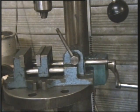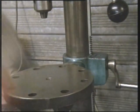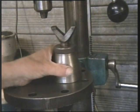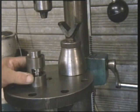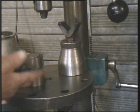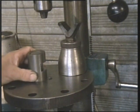While we're talking about milling machines, drilling machines, put them there. Oh, just dropped that on my toe, nearly. Okay, small jacks, adjustable jacks. This is for round stock in the milling machine, lathes, what have you. Here's a little block. It's made by a friend of mine who's a tool maker, and it's just beautifully made, and it also has a jack, and you just put a little Tommy bar in there to adjust the height, and the item can't turn as it's in a keyway. That's absolutely a little darling. I use that all the time. It's a pleasure to use.